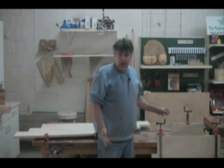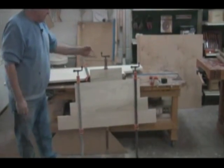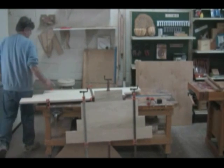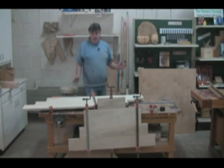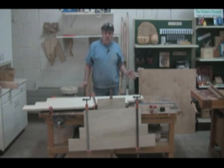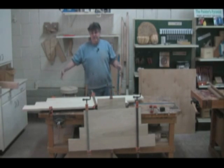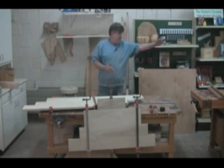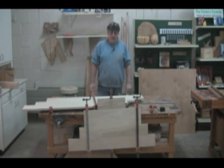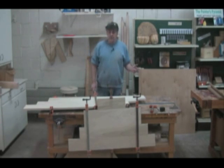Now, even the scraps will make a shelf, doing exactly the same thing in a singular. Gluing up the sides is a straightforward thing. That's just going to be two large panels. Now, if you don't have the means to work them and glue it up as one big panel, the bottom of it is 36, so glue up a 37-inch panel. And the top of it, as I recall, was 44, 45 inches, so glue up an upper panel 46 inches and go. You know, working in the short is sometimes a lot easier than working in the long.